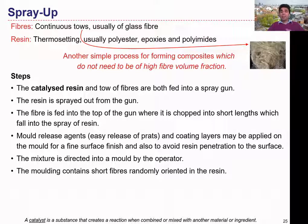We can apply some mold release agent on top of the mold surface, and then spray up some coating layers to the desired thickness — maybe a few millimeters. By doing so, we can avoid resin penetration to the surface of the component. Due to this coating layer, you will not see the reinforcements on the surface, giving a good surface finish for this process as well.